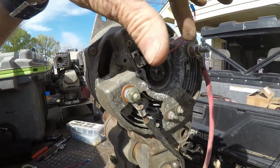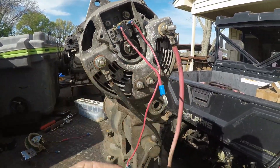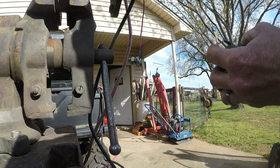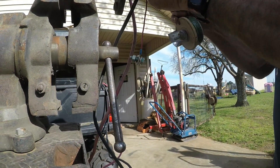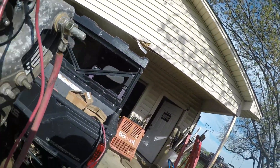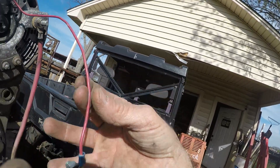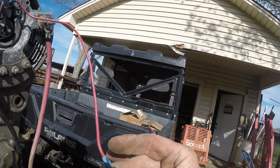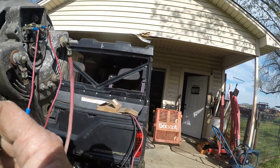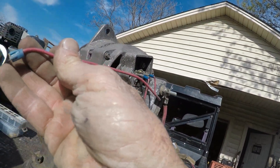We've got these wires and where they're located sorted out. Now where these two wires are going to go is through this rheostat. So I'll set this down and hook it up. There you go — a wire coming into the rheostat and a wire coming out. Then this wire comes out and the reason it has a bolt is it'll hook to your battery. Again, this is going to sound crazy — positive or negative, it doesn't matter. This one hooks to the other post on the battery, positive or negative — you just have to have one on each side.